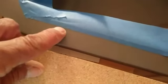Okay, because the quartz interior of the sink is finished and polished, tape will not stick. So the easiest thing that I can tell you to do, we'll put a little piece of paper on the inside. I just got a brief rim here of tape. The bondo is going to come all the way over, but when I finish the bondo, I'll pull the tape, and this way I don't make too big of a mess.